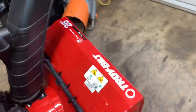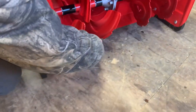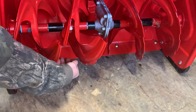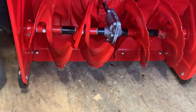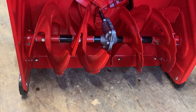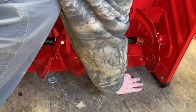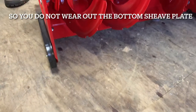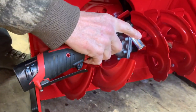If you shear a pin, also make sure you properly adjust your bottom skid shoes. These skid shoes are right here at the front. They should be adjusted so the bottom skid plate is up off the ground — this one actually isn't right now. I usually use a piece of metal or a couple of quarters: place the machine's bottom skid plate up onto the spacers, then adjust the side skid shoes. Do this on very smooth ground — asphalt or concrete works best. Place the washers down and you'll see a small air gap between the skid plate and the driveway.